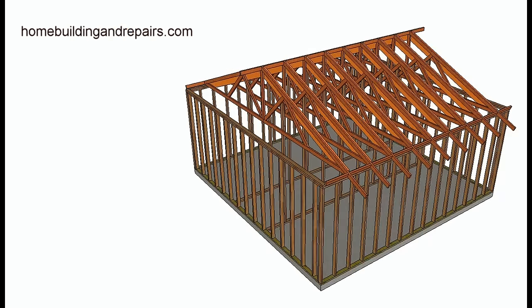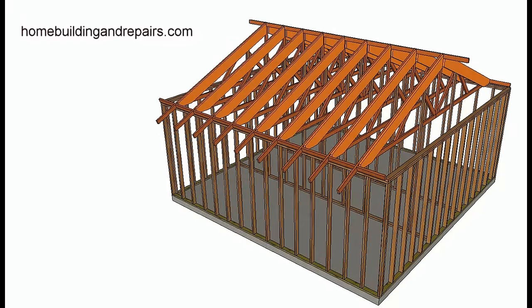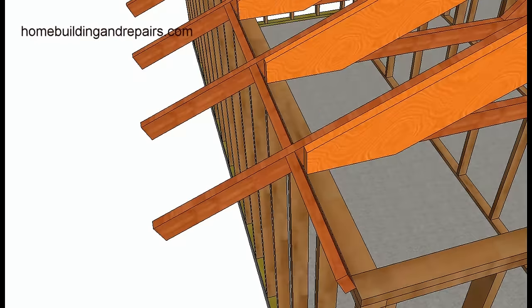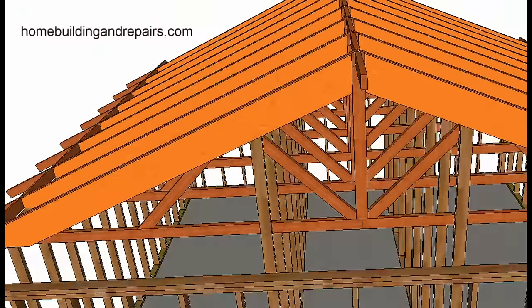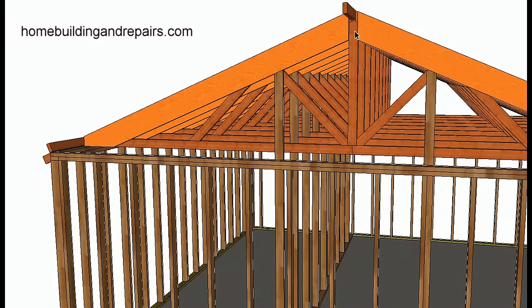Now let's take a look at what it would look like — a more realistic view after you have installed all of the rafters and the blocks. You can see here, it all depends — you could actually have a block on top of the wall and you might need to remove it, or depending on the outside finish, you might need to notch this back an inch and a half. But that would be between you and the engineer. Remember, these are just examples. Here's a block, and the beam is going to go underneath the truss.